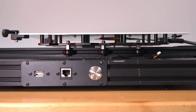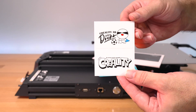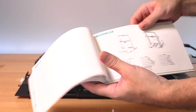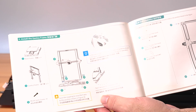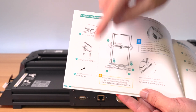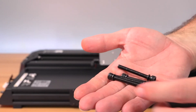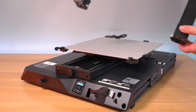For the next part, let's grab the manual. We get some Creality stickers and a nicely laid-out manual showing all the parts, included contents, and assembly instructions. For the first step, we're connecting the upper frame - the gantry - to the base with four bolts. The bolts we're looking for are in the bag, the dark ones. The gantry will sit right here and the bolts go underneath.